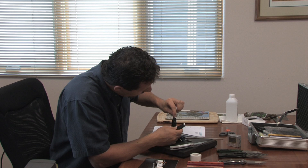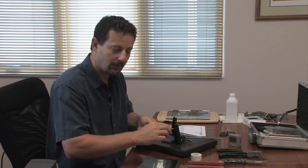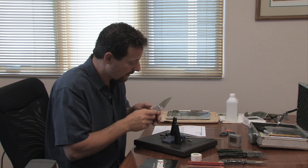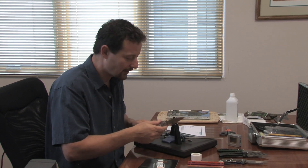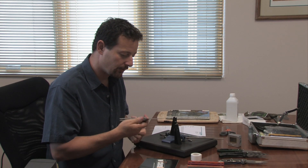Normally I run them across the whole width of the vise, but because this knife tapers all the way down the length of it, I've just put them on the front half there. Basically what the tape is doing is it's filling in the voids and allowing me to get a really nice vertical clamp on the knife and hold it really well.